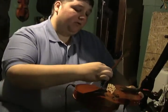Laurie Anderson's tape bow violin, very simply, was an analog electronic instrument. She had the body of a violin. She's actually a violinist, I'm not. And about where you would normally bow the violin, she had a tape playhead, and on the bow, instead of hairs, she had magnetic tape. She could draw the bow across the tape playhead, and it would play the sample that was recorded on the magnetic tape. And she could play it forwards or backwards at any speed she wanted to draw the bow.